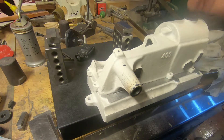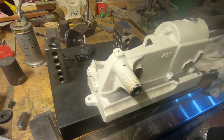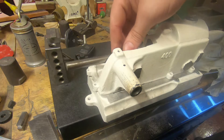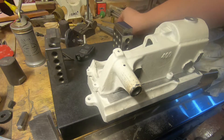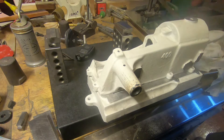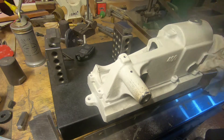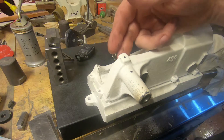The most important thing about this is that the cylinder bore needs to be exactly at 90 degrees to the crank — that's what's important. Nothing else really matters. This is a casting, so the patterns are wood, so we haven't got a huge amount of precision on the outside of this, but it's not as far out as you might think.